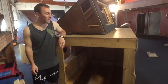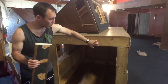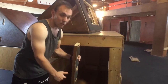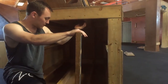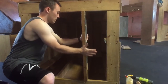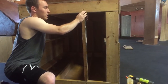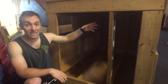So we're going to fix it — we're going to put a bottom on it. First, I want to put new studs here at the bottom, running flush from this plate to this plate on their edge, so that when I put a new sheet of ply on here I can drill in and it'll be supported all the way. I've cut this board down to exactly the right size, took a couple passes to get it right, and now I'm just knocking it into place, checking that the top of the board is flush with these existing parts.